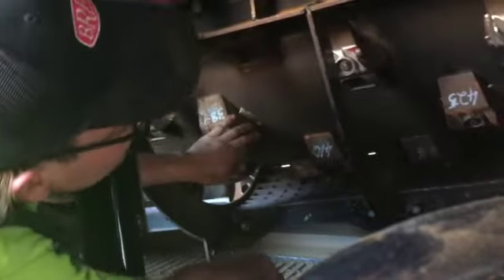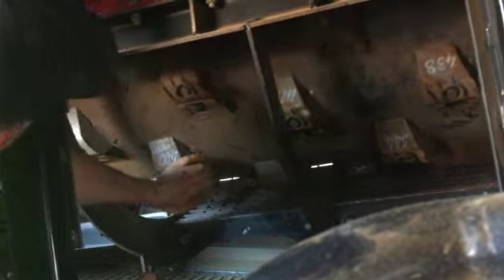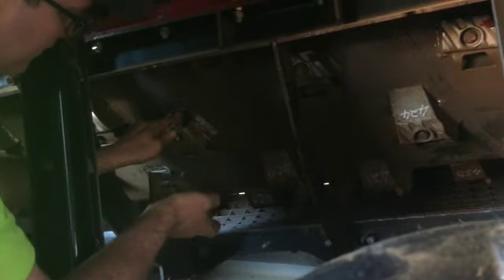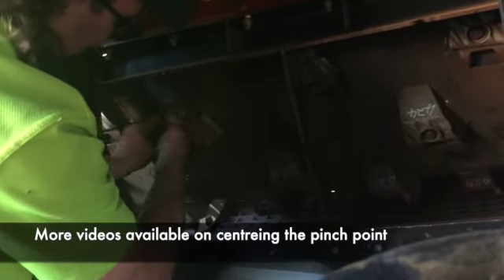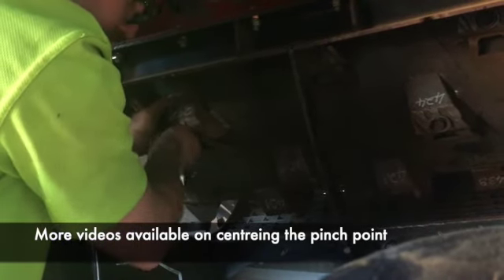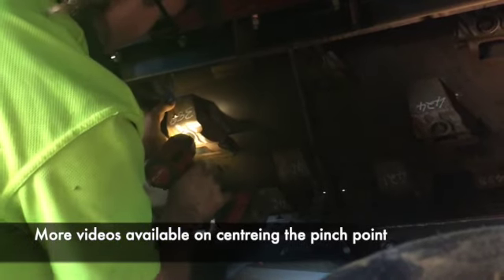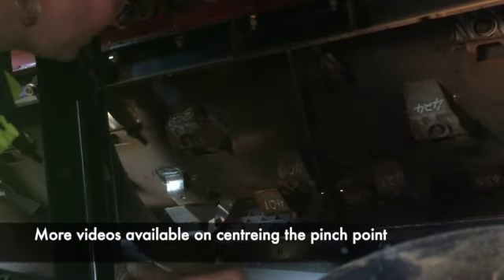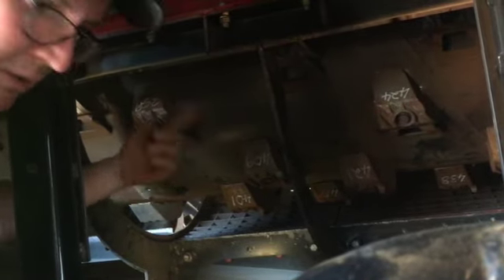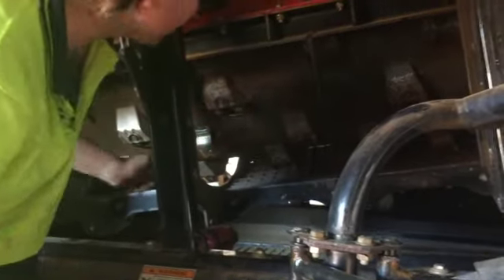And that's in line with that one, so I'll spin them around. We got that one over there and we're back here, so we know we're on the opposite side. And then to check that it's even — if it was off, the rotor would roll backwards or forwards. Since it isn't rolling, it's balanced.